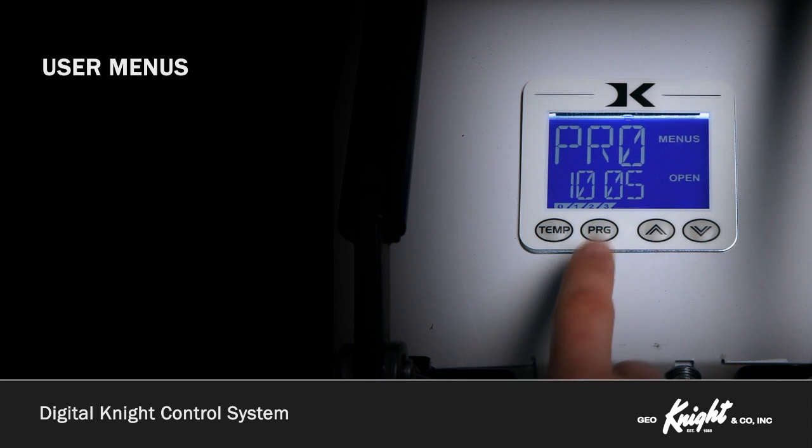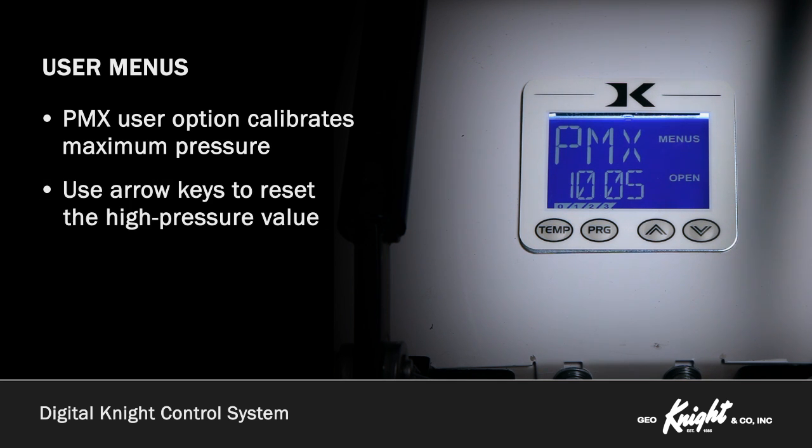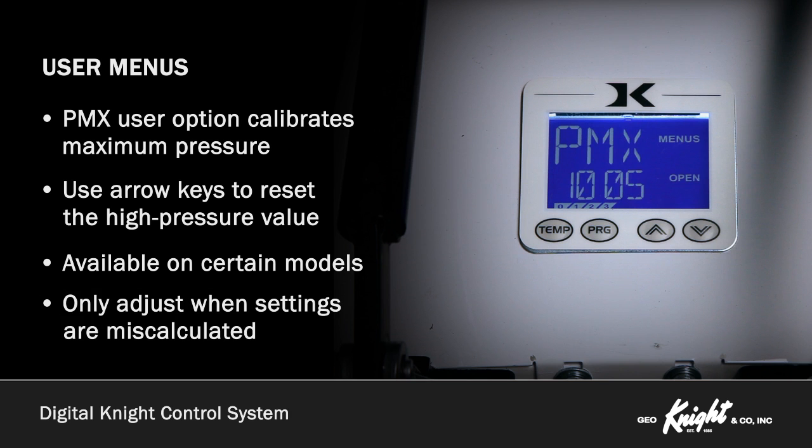The PMX setting will calibrate the heavy pressure settings when clamping and locking the press. When the desired pressure is met, press either arrow key to reset the high pressure value while the press is clamped. This feature is only available on certain models. It is important to only adjust pressure settings when you are certain that the pressure is being miscalculated.